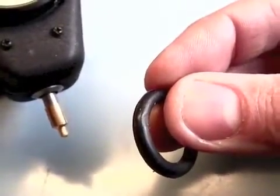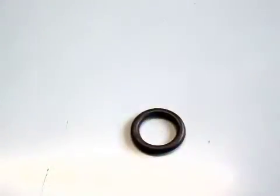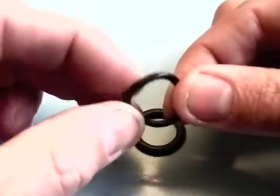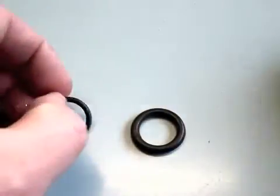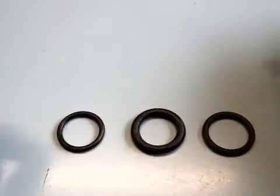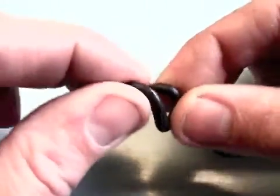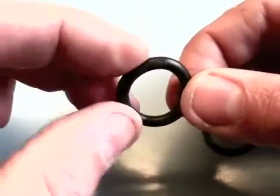So if you are going to buy some O-rings to do a repair on an air gun or anything that's got moving parts, you'd probably be best to go for a harder NBR number, such as this 90. Whereas if you're trying to fit a regulator or something into an air gun and the cylinder inside has got some deep scratches which you can't polish out, and you want something soft that's going to take the full form of any marks in the cylinder, then you'd be better ordering a softer O-ring, such as this one.